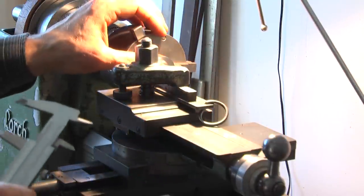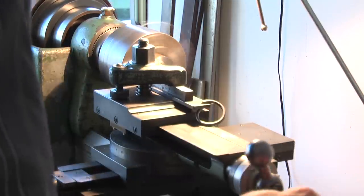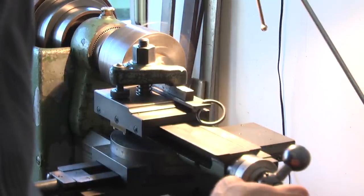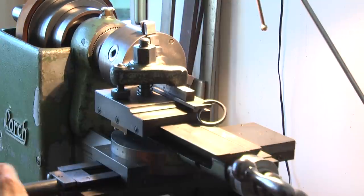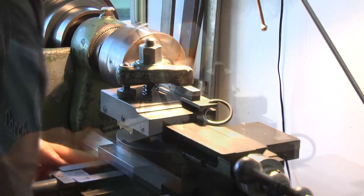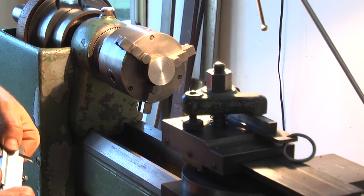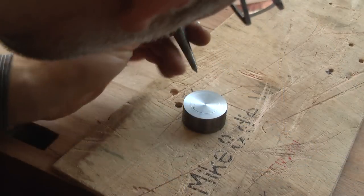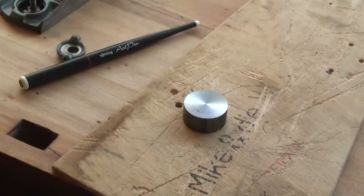I'm using my lathe to do a kind of mark on the disc, because I can move the tool steel very precisely to the position where I want to with the aid of the support, to make the drilling of the bores easier. Checking the distance and then drill the bore and do the rest on the lathe or on the drill press.